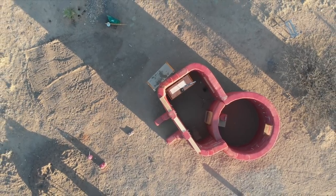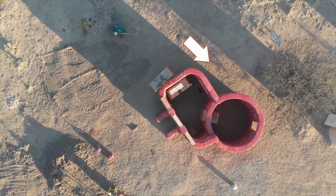We did move things around a little bit just to double-check that everything was square. We actually ended up having to move things later because we realized that the top of our building wasn't plumb — part of the building went in a little and part came out, so where it was parallel at the bottom, it was not parallel at the top. But the first day we got all that set up, and then we were able to use that string line to measure where to put our posts. We have one post in the front corner and two posts on the back to support the beams.